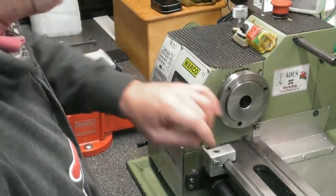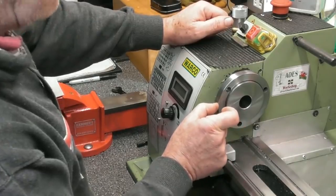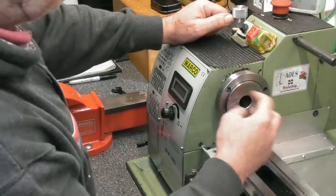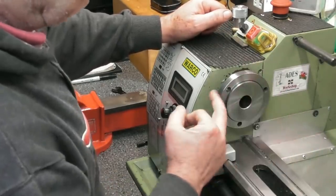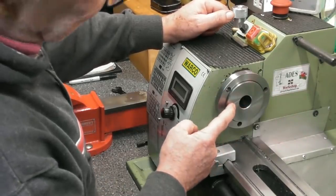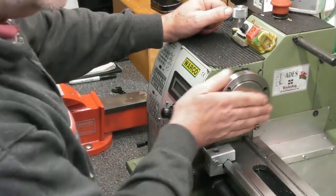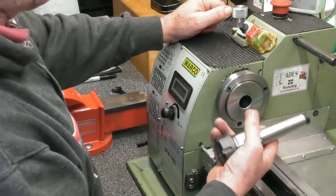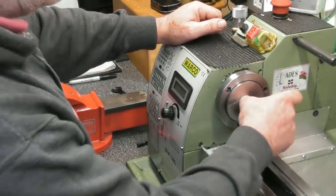All I'm looking to do is cover this up with a hole in the centre so I can still use the arbors when I need to, but so that this area is protected. The overall diameter of this is 100 millimetres, so ideally I'd have a piece of aluminium perhaps 10–15mm thick, 100mm in diameter or just over — maybe a piece of 4-inch aluminium — and machine up a protector that picks up on the three holes, bolts on with the step for the register, with a clearance hole for the centre.